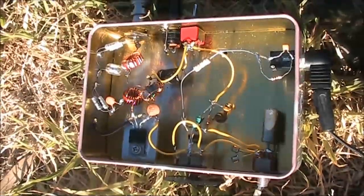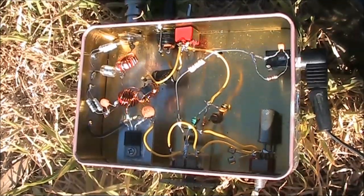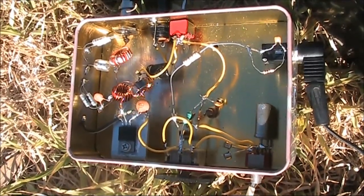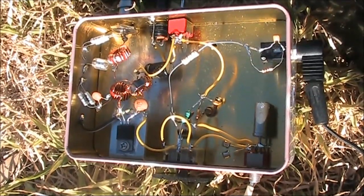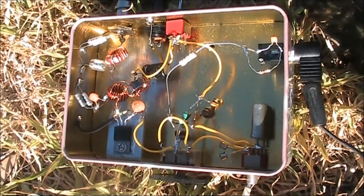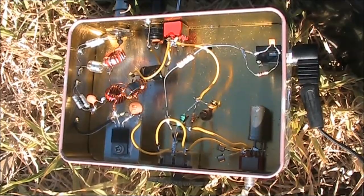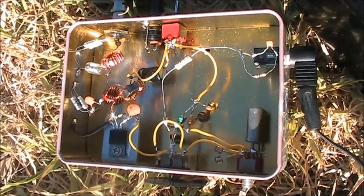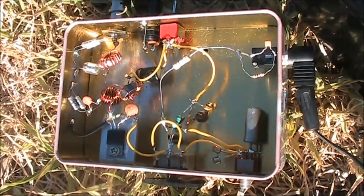Just in case you missed the last video, this is a 2-transistor CW transmitter, putting out around 5 watts. There's 2 switched crystals, covering 2 frequencies in the CW portion of 7 MHz. The crystal oscillator is a BD139 that you might be able to see just behind the variable capacitor. That puts out maybe 200 milliwatts to drive an IRF510. Keying is done by shorting the emitter of the oscillator transistor to earth via a 15 ohm resistor. More details in the previous video.